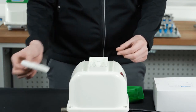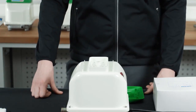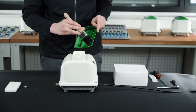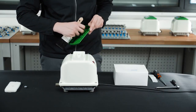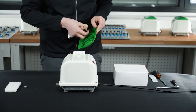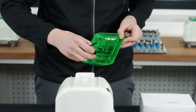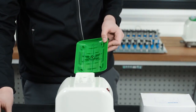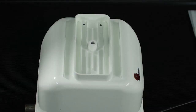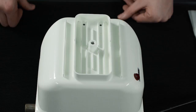So it's best to fix the cause of the problem as fast as you can. If any signs of foul air are apparent, you would be well advised to extend the pipe work to enable you to relocate the pump. It's very important the pump can only breathe in clean, fresh air. Clean the inside of the filter cover, for example with a brush. Do you notice the inlet holes? If necessary, clean also this area with the brush.